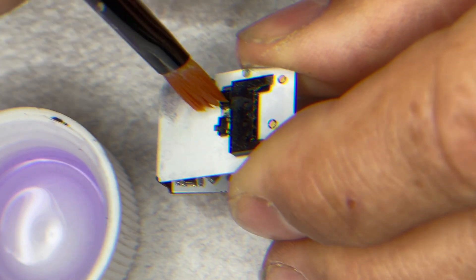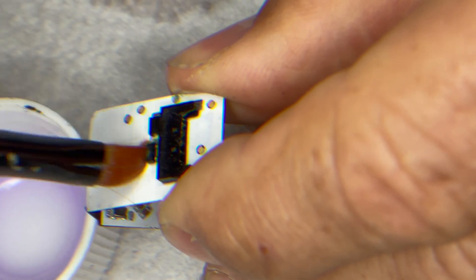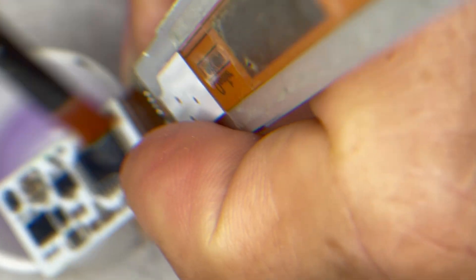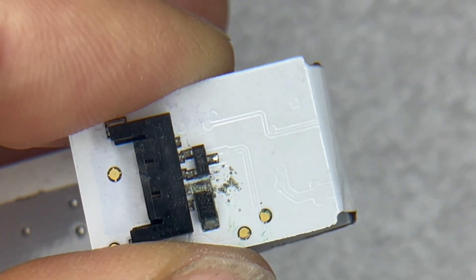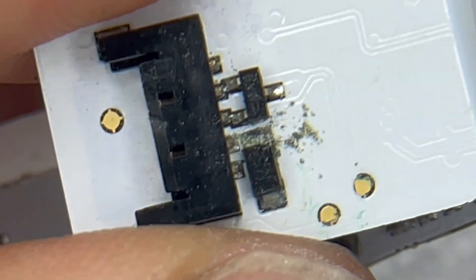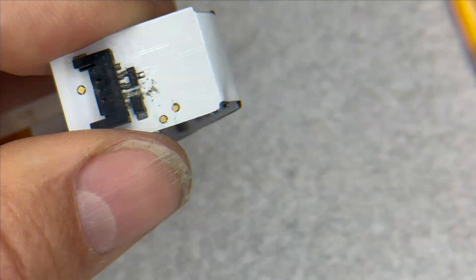If it's a conductor that will short across lots of different pins. Let me just wipe that — there's sort of a grey material coming off there which is probably the electrolyte. Let's give it a blow as well. It was these components here that were marked as possibly shorted out, so let's give them a good rubbing, all around there in between the chip legs. In particular there was a little bit of crud between those two black boxes on the right-hand side.